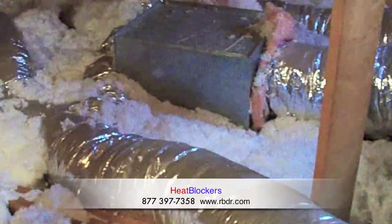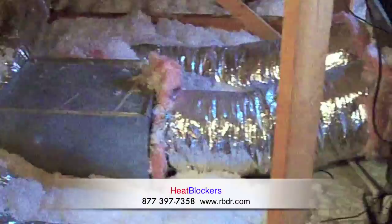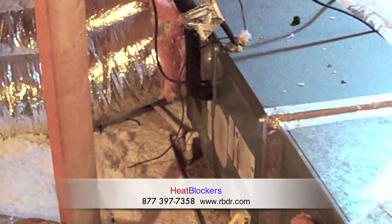As you can see, we've got one air-conditioned unit here. This is the plenum. This is going to be the return air on that side — that's a junction box for the return air. And you can see the way the ducts are attached to this plenum: they are just zip-tied. They're not sealed from the outside.